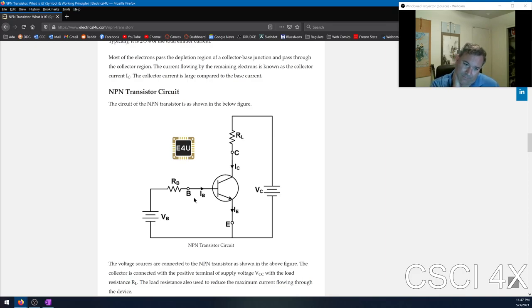But basically, the difference is in the sorts of loads they carry. A transistor can turn on and off very, very quickly. This is a semiconductor device. If you have a voltage going high and a voltage going low, the transistor will turn on and turn off, depending on your characteristics, maybe millions or billions of times a second. Whereas a relay is a spring and a magnet, and you hit a thing and it slams over, and then you turn it off and it slams back. You can do it maybe 2 times a second, and you're probably going to burn out your relay if you're doing that all day long.